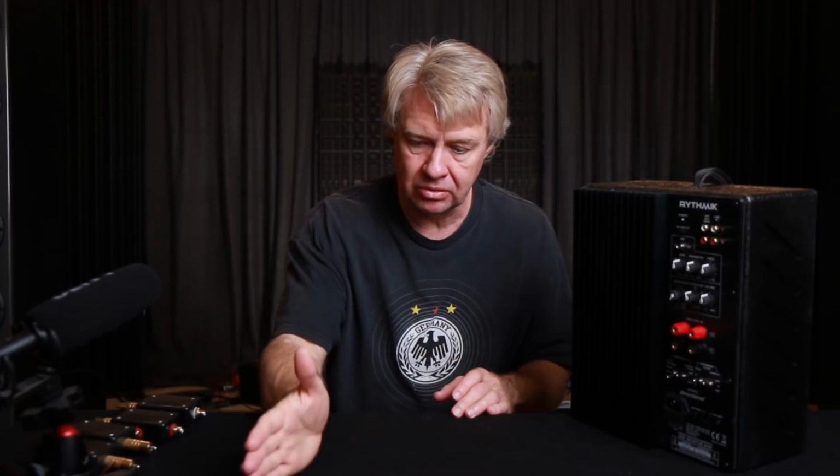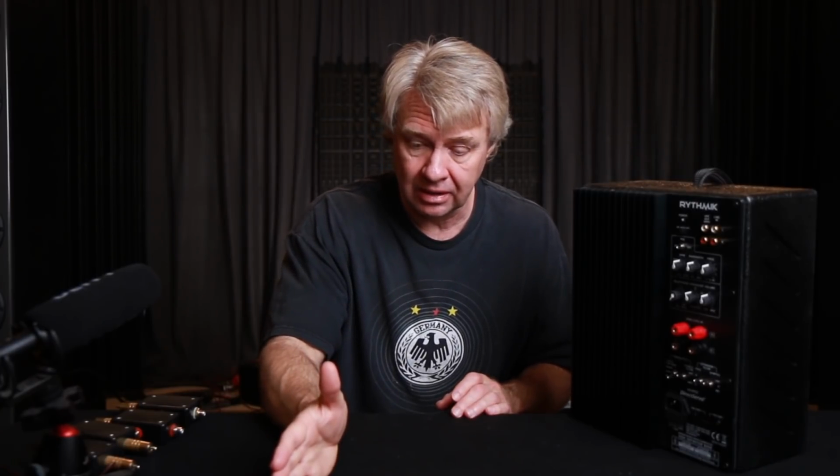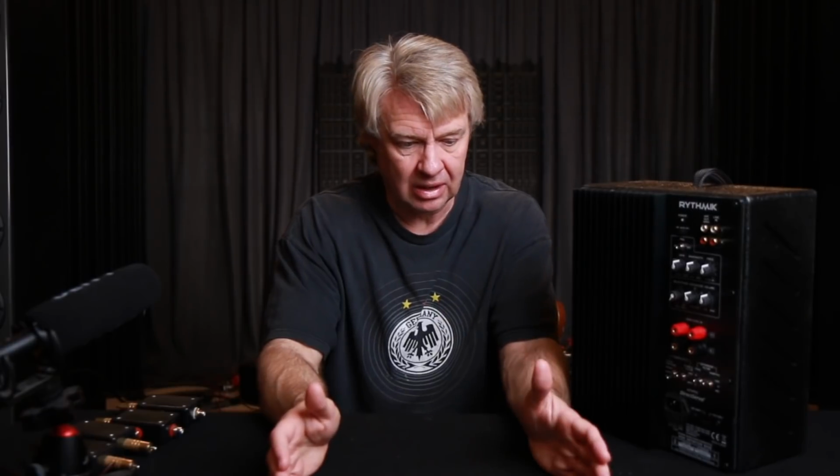And you're going to have a response at the bottom that might be doing this when, if you just look at a single speaker, maybe it's not. You want to measure just your left speaker and then the servo sub for that left speaker or the woofer for it. And then you want to measure the right speaker and just the woofer for that one. And then you measure each of them independently and then measure the sum. And when you're measuring the sum, you're looking for it to create that balanced response. And I'm going to walk you through the ways to do that.